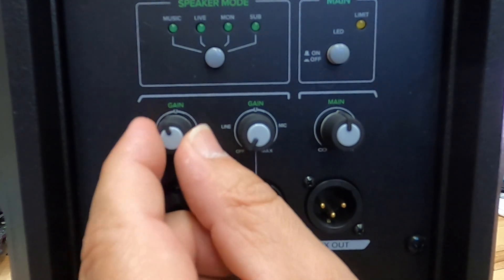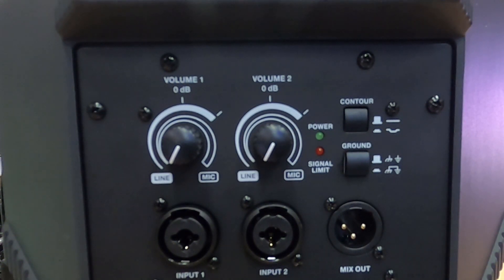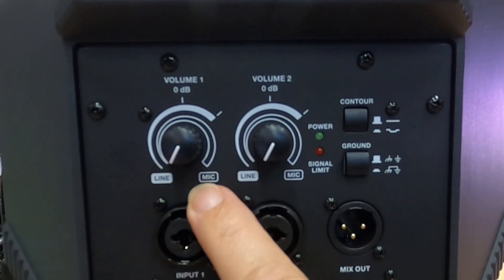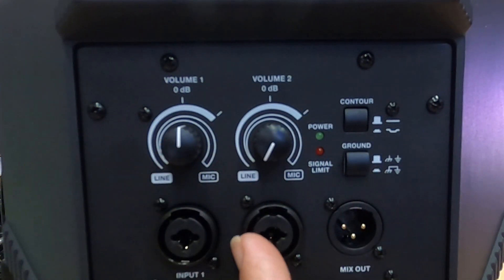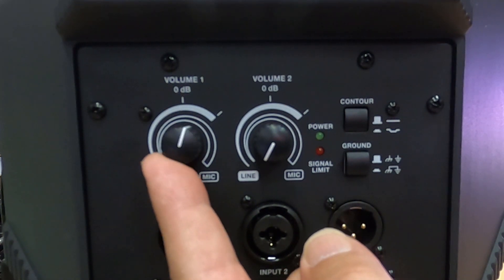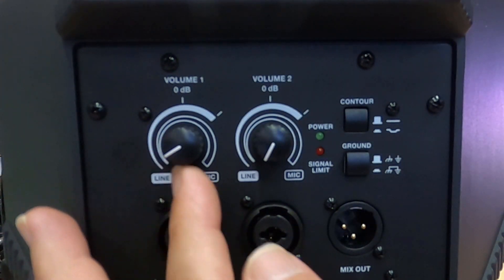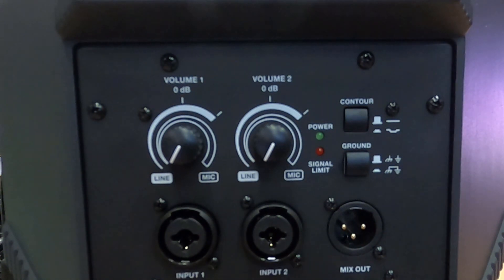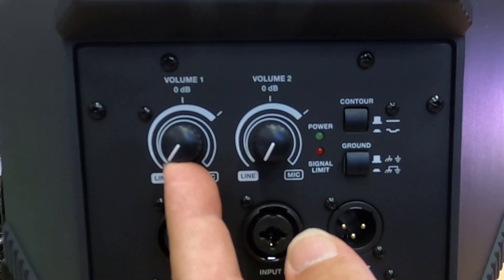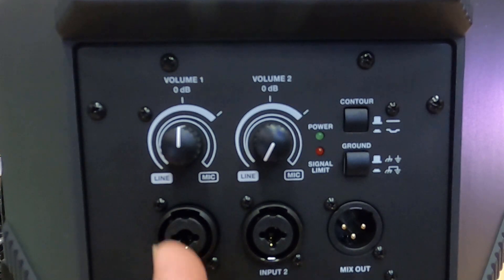So — gain above 100 for mic, line input from zero to 100. Now this is the Alto TS310, which is slightly different on the back. On the back of the Alto, it clearly labels 'line' and 'mic,' and at the top it says '0 dB' which is the unity point. It also indicates you can increase the line level to at least 110 or thereabouts before a transition occurs. Line level starts completely off — their speaker runs hot — so as you increase this, it increases the overall power going out of the unit.